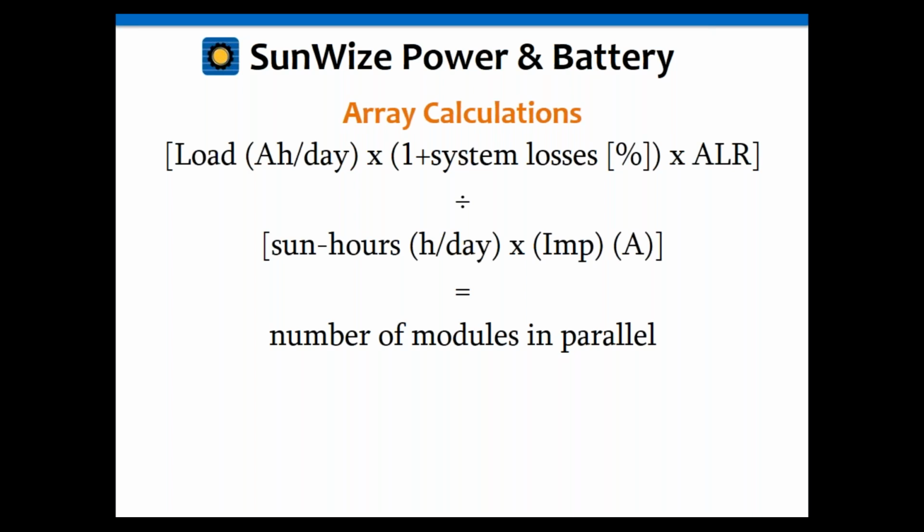So you also have to select your solar module in advance, and that's one of the other problems with this. I have to decide, and you may not know whether you need a 40-watt module or an 80-watt module when you start this process, so you may have to go back and do it again. You may find that your 80-watt has been oversized and you can use a 40-watt instead. We're actually going to show you an example of that happening by accident. We were updating this webinar when we discovered it. But keep in mind that you have to pick your solar module in advance as well and see how well it's going to work.